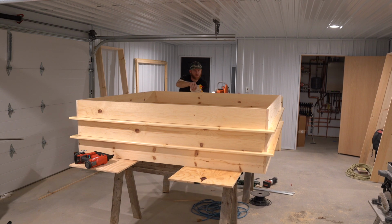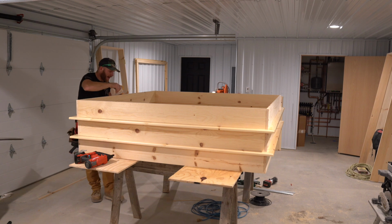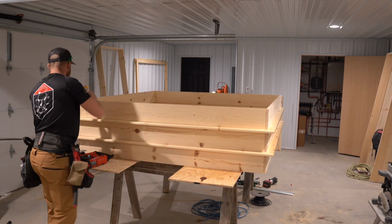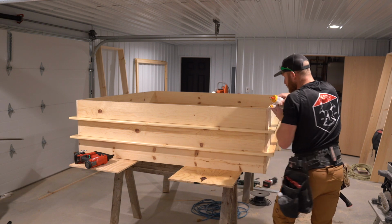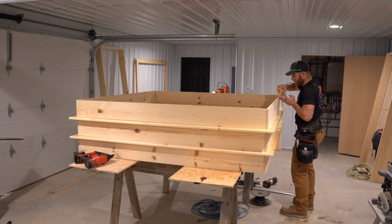I still have one of these big windows to cut up and assemble. However, when I was doing my measurements, I was a little bit off on my box depth. Everything was 6 5/16, but one of those corners was 6 3/16, and another corner on one of these big boxes was like 6 3/8. So I'm not sure if there's an issue with the framing lumber, or if the window isn't set all the way in on the opening.